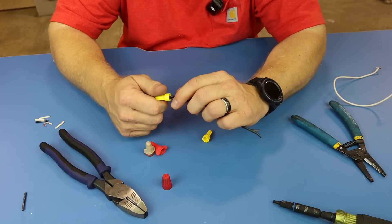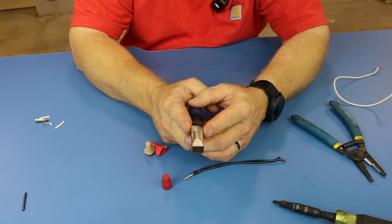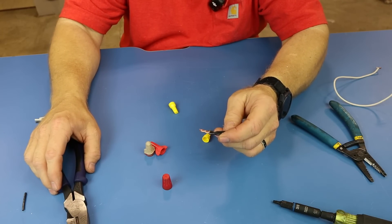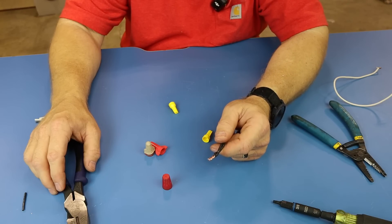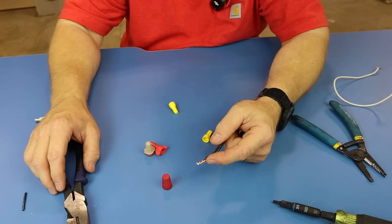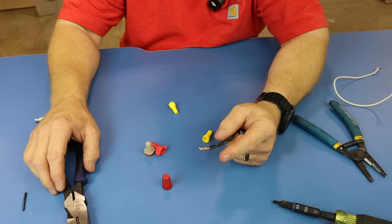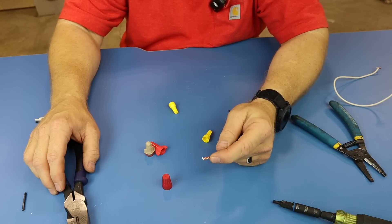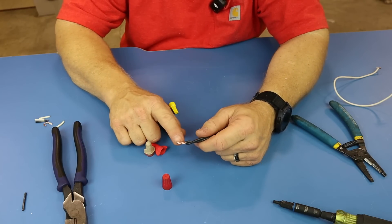That's how I want you to do it. Remember this width — it is the perfect width for a wire joint. Twist your wires, always twist your wires. I know what the wire nut bag says, but if you're in this class or any of my classes in the future, or around me on my job, and you don't twist, I will fire you. I don't care how good of an electrician you are. This is your weakest link right here — any splices that you make are your weakest link. You want to make it as tight as possible so there are no issues ever. Anytime you compromise any wire, it's your weakest link.